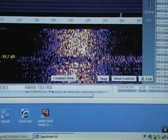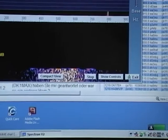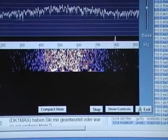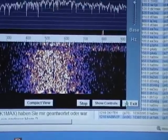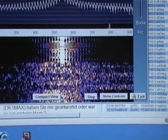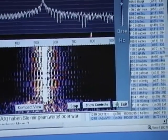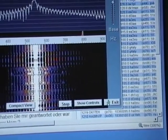The bright band on the waterfall display is the G0GHK Beacon from Finningley. It's a rain scatter signal and has a very broad characteristic. This compares to my own signal, which is sending dots and is quite a strong signal into the sound card, so you can see the difference between that and the rain scatter signal.